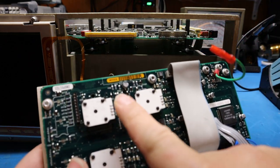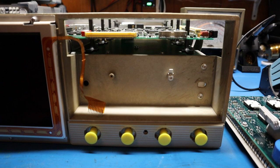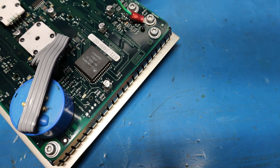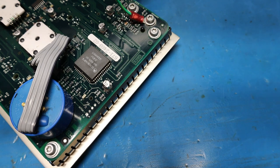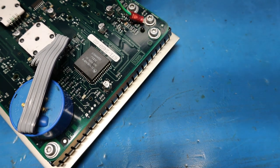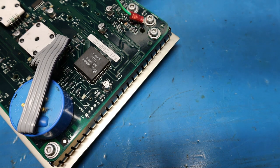There's your front panel, completely out. The capacitors here need replacing — I didn't change any of these the first time around. I'm going to show you how to properly remove SMD capacitors without lifting the trace. This is especially important when the leads are corroded due to electrolytic leakage. Most people I've seen either try to heat each side and lift it out, or use a heat gun, or add flux. Those methods often damage traces because electrolytic fluid attacks the alloys in the solder, raising the melting point — so you end up needing much higher heat, which risks damaging traces and surrounding components.